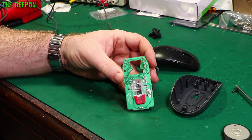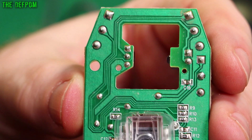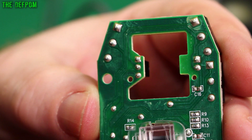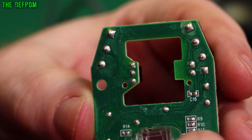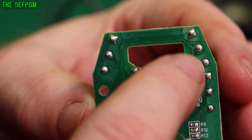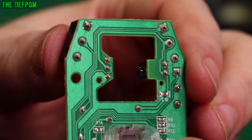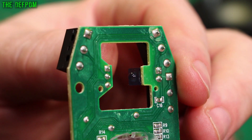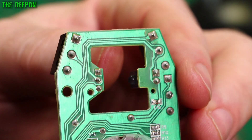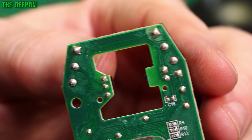So let's have a close look at the circuit board. It might be in and out of focus as I move around. So this is the button I'm going about - it's up this one here. Those three pins. I'm just trying to see if I can see any cracked joints on there. It does look like there might be something actually. That square pad looks like it might have a crack around it - in the solder joint.